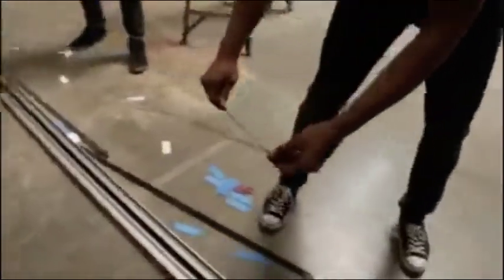Take the bottom string guide to the base of the cassette where the strings exit the cassette. Carefully loop the strings over the guide, ensuring they are in order and not tangled. Slowly move towards the operating jam, keeping the strings in line. Now refix the string guide back in its original position, flush with the end of the track.